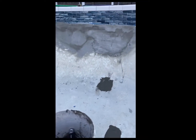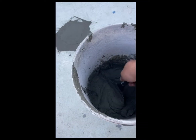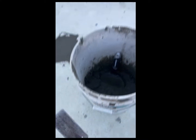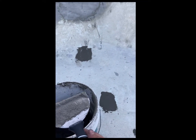Here are a few mistakes I made that I'd recommend not making. Number one: mix the consistency of your material pretty wet — see how wet that is. That's at least probably how wet you want to make it. Number two: I have three different types of tools here — a drywall knife, a flat trowel, and a margin trowel. The best tool so far has been the drywall knife, because it flexes well. As it flexes, you can follow the curves of the pool and fill in and clean up your mud a lot better.